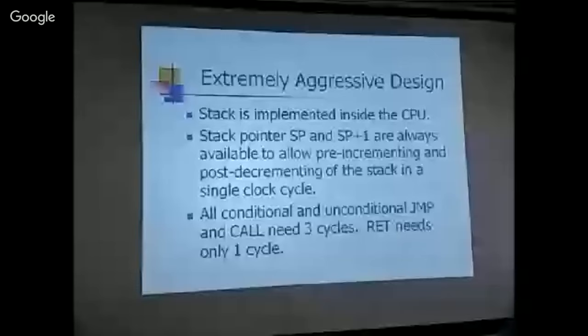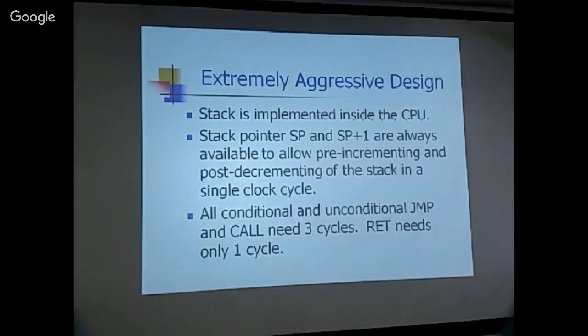And yes, it has no multi-byte opcodes except when you need immediate data. The immediate data, you load immediate, call and jump, they all need two more bytes of 16-bit data, and you have to spend clock cycles to read them. And if they are 8-bit data, these are the 2-byte instructions, so you need one more cycle to read the data off the bus.